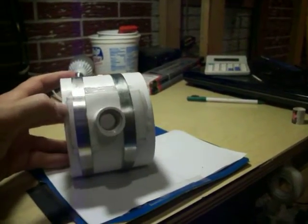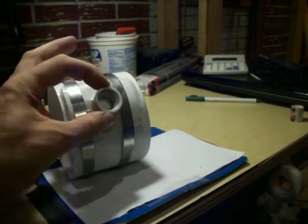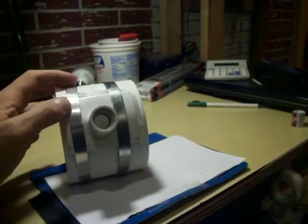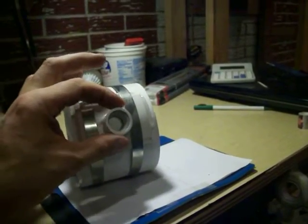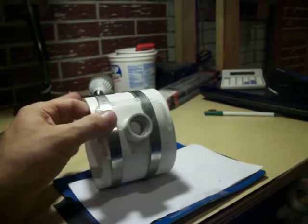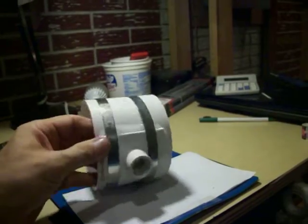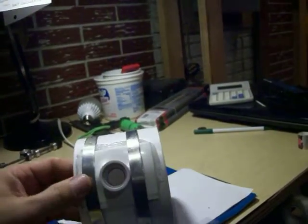The way I manufactured this: there's the four inch coupling, and this is actually a two inch coupling with a half inch female national pipe thread fitting on the end of it. I took the two inch T, ran it through the band saw, put a six inch black pipe nipple on the end to keep the threads and size consistent, then used a heat gun to heat up the PVC until it turns soft and used the coupling as a form to press the pliable hot PVC up to it to get a nice radius. You can see the radius right there, which matched the coupling.